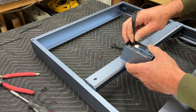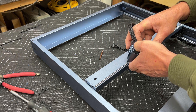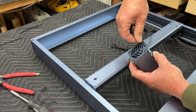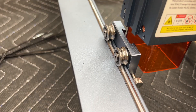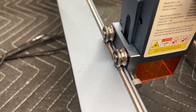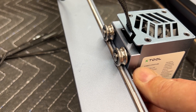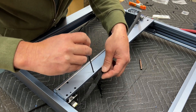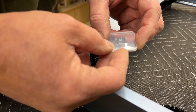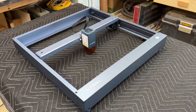There are no drag chains on this machine at all, so the wires just flex as the pieces move. The X-axis wire is not a problem, but the Y-axis wire tends to lay on the side of the machine and could possibly work its way into the workspace — that's one of the few drawbacks I found. The D1 comes with a micro SD card that gets inserted into a slot on the circuit board, and that's really it as far as assembly.